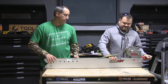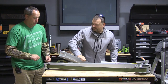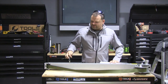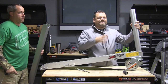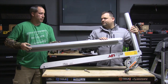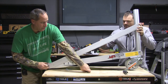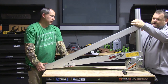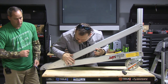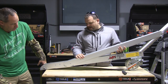Give me some slack — there we go. It comes apart. You could do it with one person, but having a second person helps. I'm going to flip it upside down. This is the base pole, and there's a slit in it — that's what's going to go into the crane itself. I'll put my pin in right here, lock it, and depending on where you want to go, there are all these holes: 500 pounds, 600 pounds, 700 pounds. Let's go to the maximum lifting capacity.